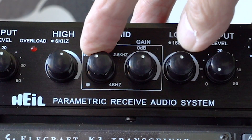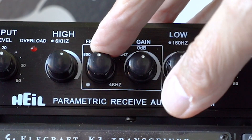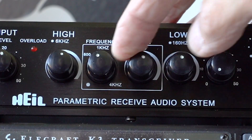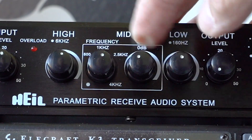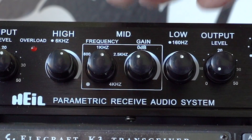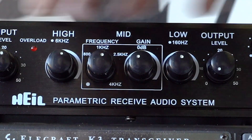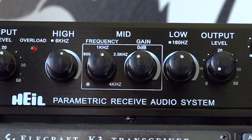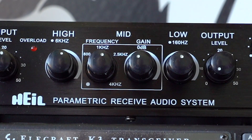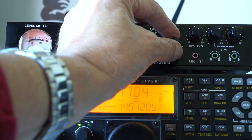You can move this tuning control within the audio passband, so with the tuning control and the gain control together you can actually select a part of the passband to boost or reduce. By adjusting these controls you've effectively got an infinite amount of settings, and each setting you want will be dictated by how you hear — or how you want to hear — the signal. You can manipulate the audio passband quite dramatically. On the end there are also a couple of controls for headphones and recording.